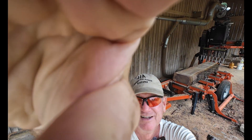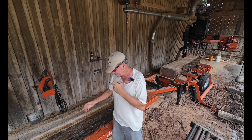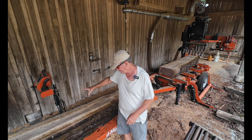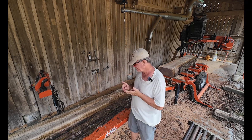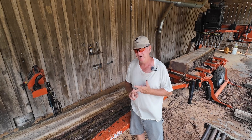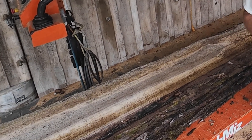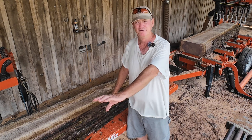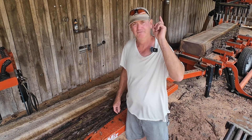They sell like crazy, which is good. They yield extremely high ratios of wood simply because you're going edge to edge and bark to bark. I hate bark, and you're not having to edge trim, so you're not getting edge drop. So when you're sawing logs that have a potential market for charcuterie boards — walnut, cherry, a few others — you have to think about which pigeonhole this log fits better into. The best part is I can stack these boards right on top of my normal four-quarter stacks of lumber, so I don't have to change my air drying times, my kiln schedules, any of that stuff. I saw them, stack them, dry them, sell them. It's easy. There's nothing hard about running a sawmill — you just got to use the brain.